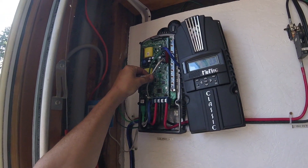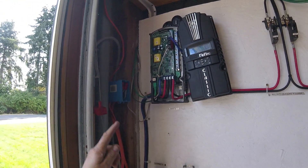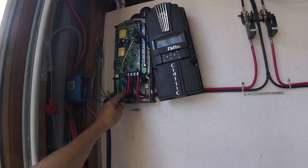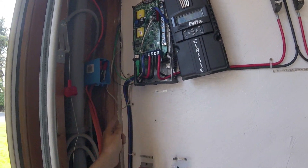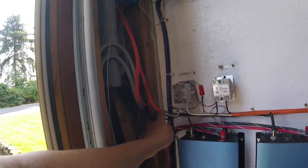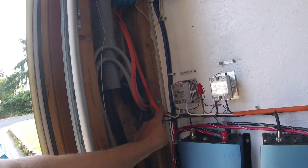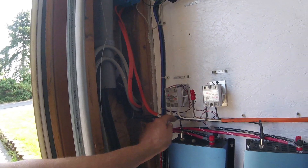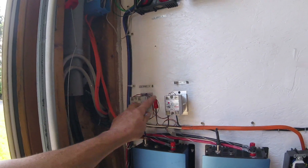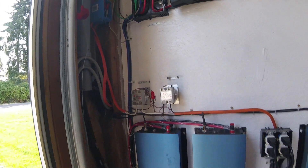These are the links which tie the Midnight Solars together. And then this little wire right here goes down — that's what shuts the solid-state relays on and off. This is 240 from the house — I'm just used to calling it 220. It splits line one and splits line two. That's what shuts line one and two off. They're 40-amp. And I haven't had a single problem with any of this equipment.